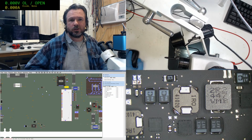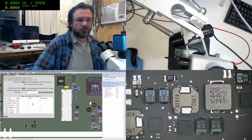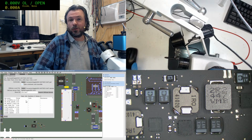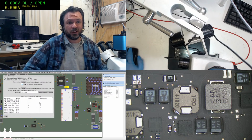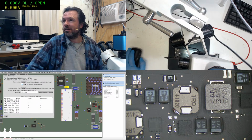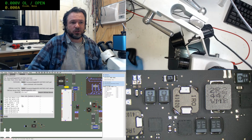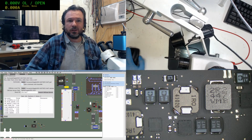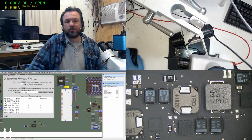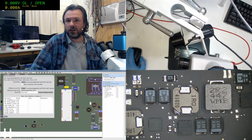Alright, let's have a look and see what we've captured so far. So, with the 3437, we've already captured 161 nets, just in what we were doing there. It's 161 different networks, so that's pretty good going. It'd be pretty hard to get that sort of number of entries that quickly if you're doing it by pen, paper, or call-out system. I mean, that's fine if that's all you got, but I gotta say, it is kind of nice having the multimeter and the foot pedals integrated in.